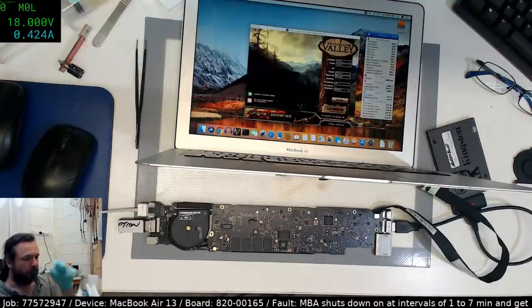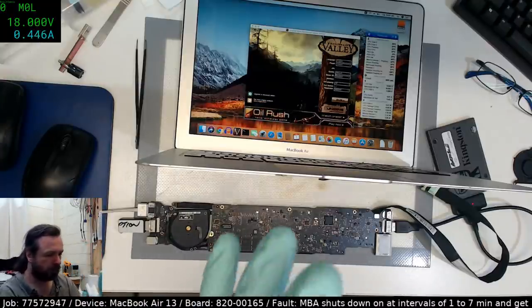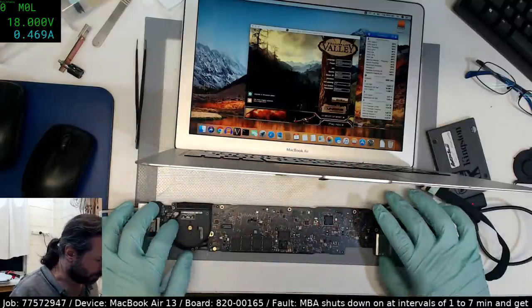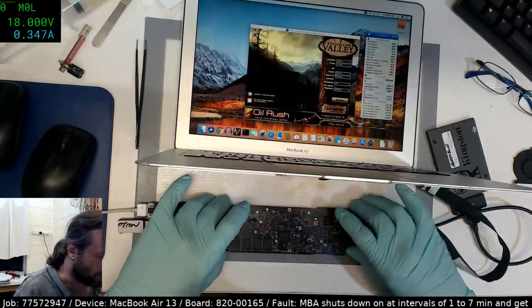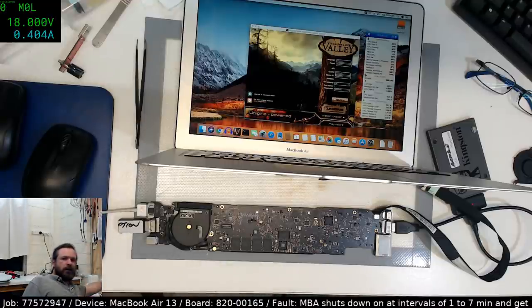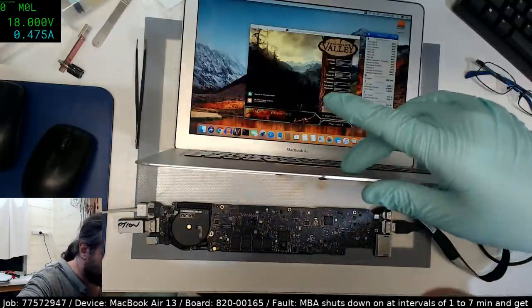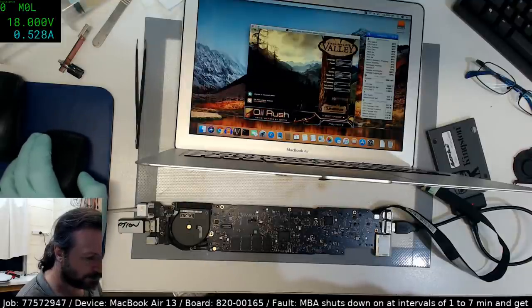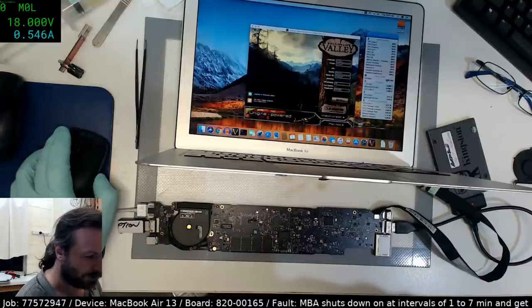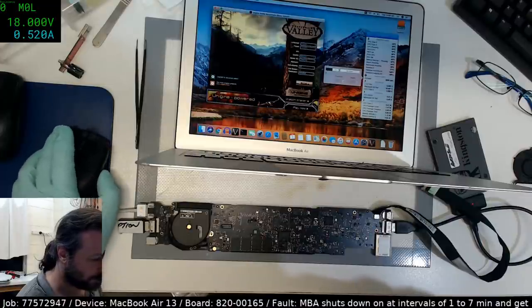The other possibility is maybe it's something to do with the signaling it gets from the trackpad and keyboard, potentially. Maybe it's messing up something there, misinterpreting something. Because we'll give it another couple of minutes, but right now this thing is sprinting along just fine, other than the fact that the fan's going absolutely bonkers. I don't use Furmark. This is, obviously, Valley. Interesting, the fan's running at 6,500 RPM, so SMC is definitely confused as to what's going on.